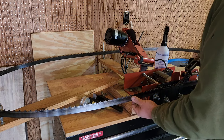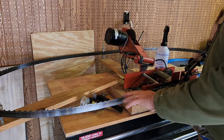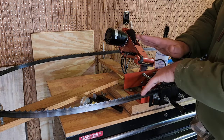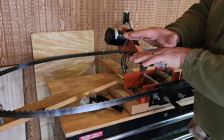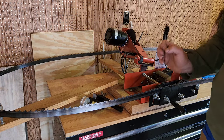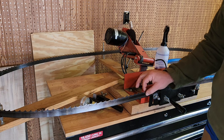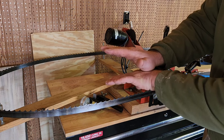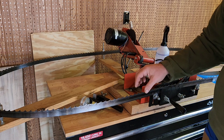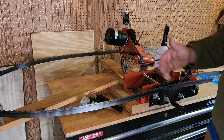Make sure you're seeing a solid stream of sawdust coming off. If you're seeing dust come off, your blade needs to be reset. If you do not have enough set in there, you're building up heat, and also it doesn't give your blade any guidance. When it's offset properly, the blade knows how much material to take off. If you don't have it, your blade might wobble through the wood because it's not taking a clean path — you have nothing that's leading. It's only following based on the grain structure, and the center raker tooth follows the path of least resistance.